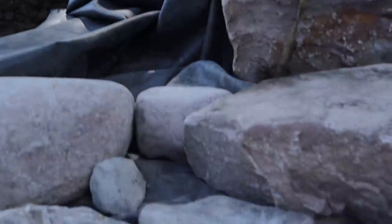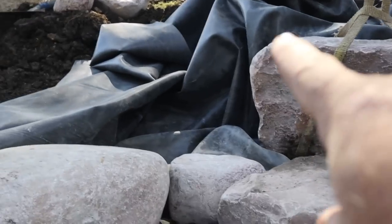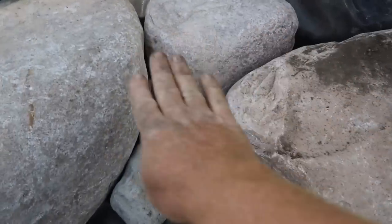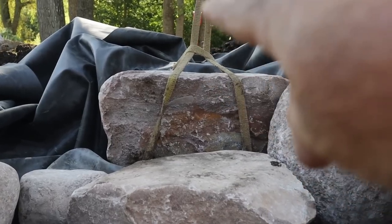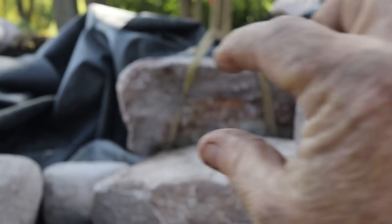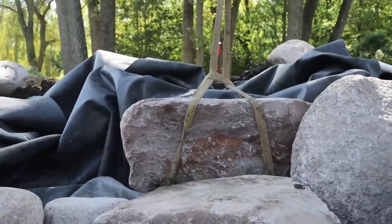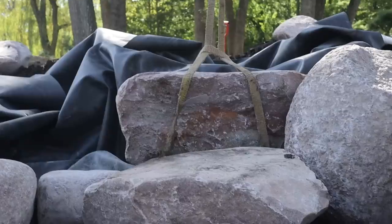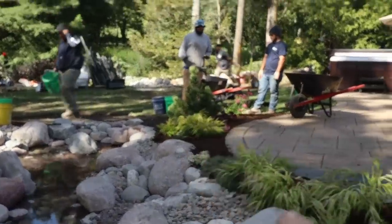JD and I have been working on the waterfall over here. The idea is water comes through this area, twists hard, comes over that, and then I get a big drop there - and all of this fit together really, really nice. The challenge is I need another frame rock right in here. We always like to put the frame rock in front of the spillstone to disguise that joint - I've only got this much space to try to get something in front. I might end up moving this rock, getting a rock in there, and piecing it together with something smaller. We dry set this first before putting the snout on, making sure we've got the right height. We purposely built this up so this stone would fit right inside there, and we're right at where we need to be - about a half inch short, but once I get the snout on and throw some gravel underneath, that will lift it just above the snout and I should be right in line.